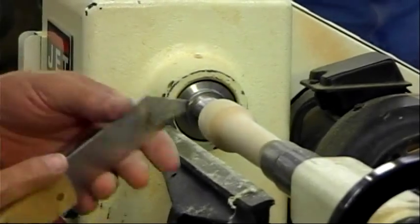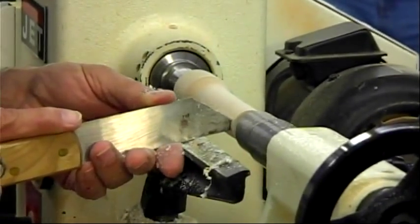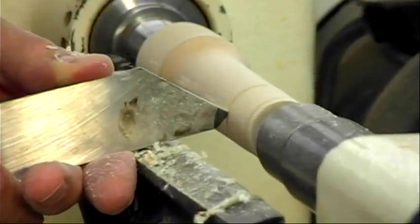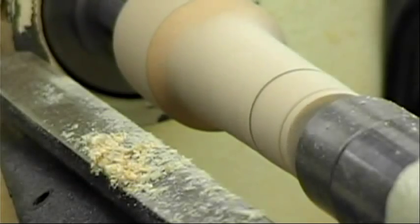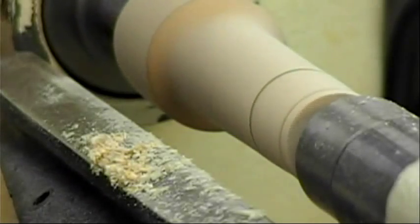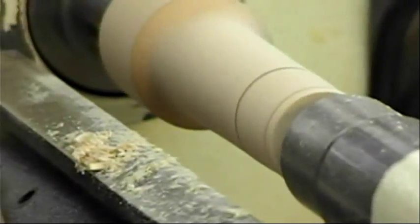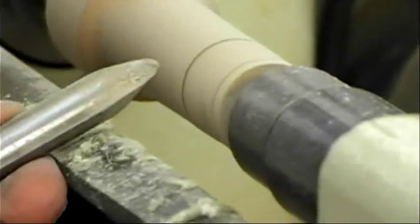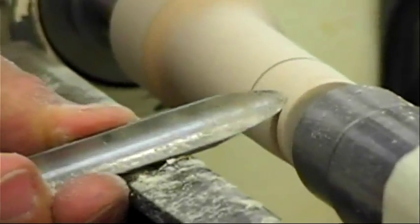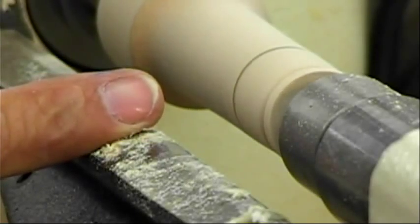Now we come back. The spindle gouge does not like to make deep, heavy cuts. So I like to have a mark where I can cut short. So you mark that for the ball. You were measuring around it, and now you're using it for the width. So the width and the height are the same. It's more likely to be a ball. Now your eyes will tell you that is not the same width as it is height, but it is.